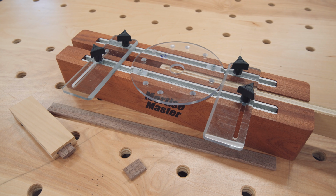And once you do it one time, then you can batch out all of the mortises. So keep in mind here that we're basing everything off of the center line. We're cutting the joints based on the center of the joint, and we're lining everything up with the center of the jig. So that means we're going to basically determine our travel on either side. So if we're working off the center, everything needs to be divided by 2 for this side and this side.